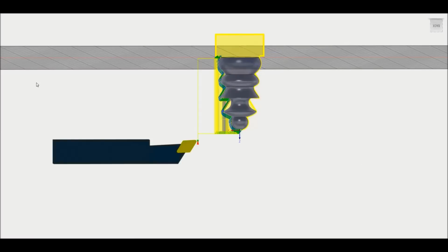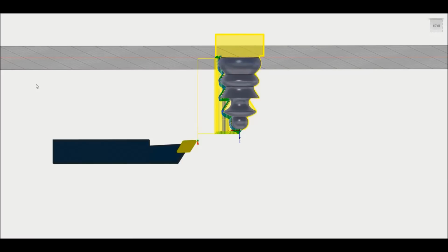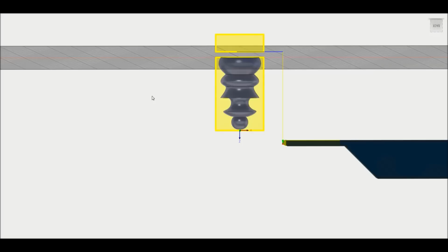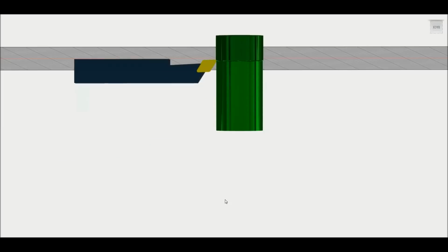So, yep, that's that. And we have the toolpath generated now, both toolpaths. And here's where things get interesting: these are two separate setups. So what I'm going to have to do is hold control for setup one and setup two. Now you see they are overlapped, and I'm going to post-process, or rather simulate, both of them at once, and let's see how that plays out.